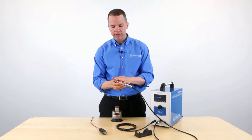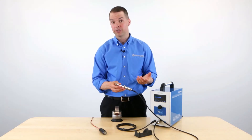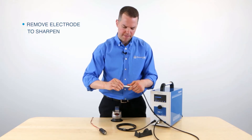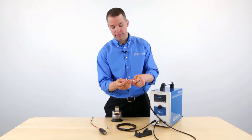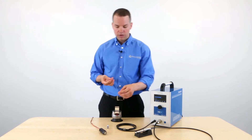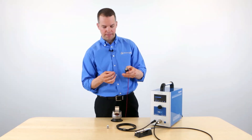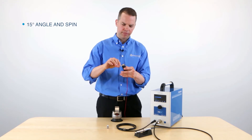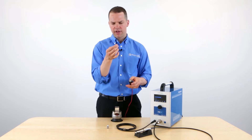It's very important to ensure that this electrode is sharp and clean in order to get the best results. What you'll need to do is remove the electrode — slide this cap off, loosen this nut, and then you can remove the electrode. I then use the electrode sharpener, which has an on and off switch on the side. Press that, then apply the electrode at about a 15 degree angle and just spin it until you get a very fine and sharp tip.